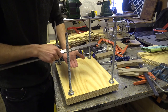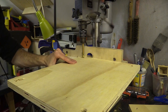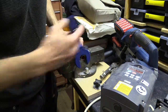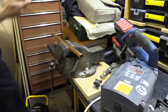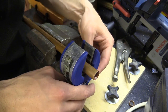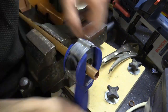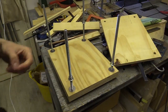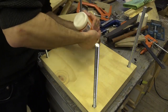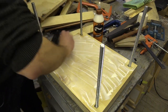I'm going to work on the plunging section of the press now. I decided to drill the guide holes of the plunge section to the same diameter as some copper pipe I had — the original 12mm holes were too small and would snag. The pipe or bushing would help the section move across the threaded rod a little more easily. I used a pipe cutter to cut the copper to 36mm length and a deburring tool to clear the ends out. I then glued the two pieces together, clamped them and, while the glue was still wet, pushed the copper pieces into their openings.